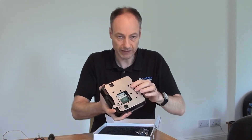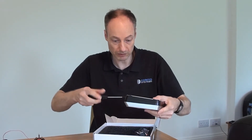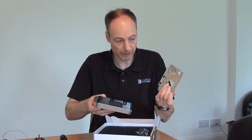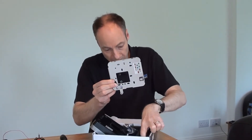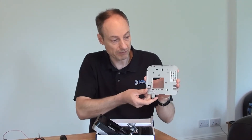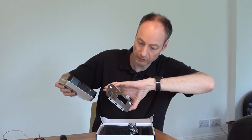Now, it has, already attached to it, its metal backplate. Like just about all Suprema clocking terminals, it uses a metal backplate for mounting to a wall or a flat surface. It's held in place by a small grub screw at the bottom. That would be what you would use to screw to the wall. It comes with some wall plugs and screws, which is handy. It even has a little colour guide on there for some of the connectors. So, got that screwed onto the wall — this then hooks into the backplate and is secured at the bottom using the little grub screw.